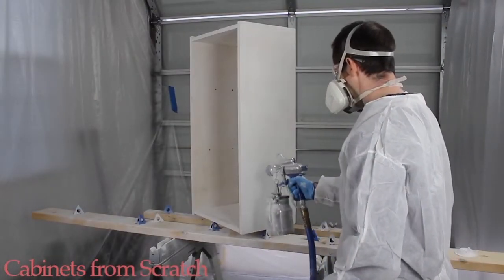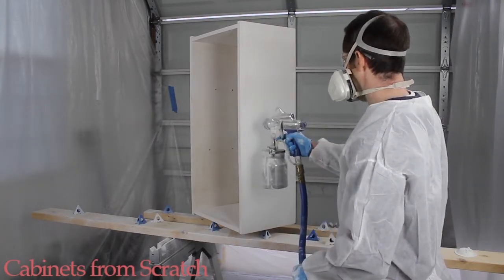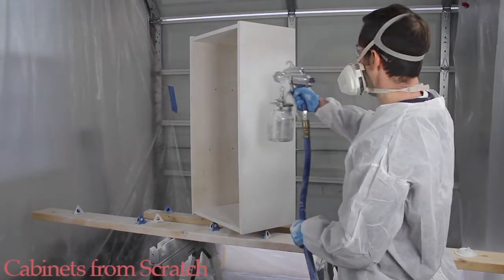There's a good finishing tool I would recommend you pick up, depending on how you plan on finishing your cabinet. When the cabinets are all built and sanded, you have the option of staining and applying polyurethane, or priming and painting. If you go the priming and painting route, having a sprayer works really well. Sprayers come in either an HVLP — high volume, low pressure — the kind you see in car shops, which shoots a very fine mist of highly atomized paint and gives you a nice even coat. Almost all professional cabinet shops spray their polyurethane with a gun rather than brushing it on, and you can do several very light coats to get a nice even finish.